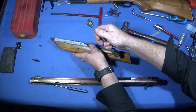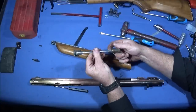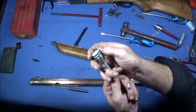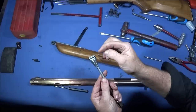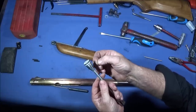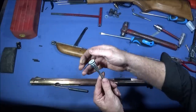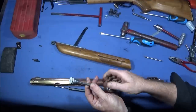And that's the pump assembly. And that's the PTFE seal that I made there with an O-ring in. And there's a bore on the front of this steel part here with a lip on the end. And all I did was turn the diameter to the groove or the inside bore size, and then actually put a groove on the actual diameter of the PTFE. And when I pushed it in, it clicked home, so it can't actually come out when I withdraw the pump or work the pump.